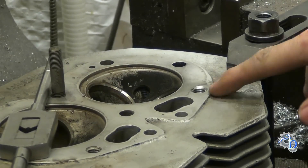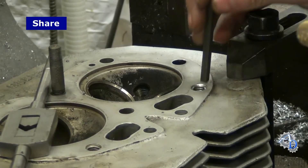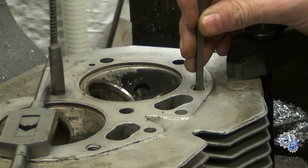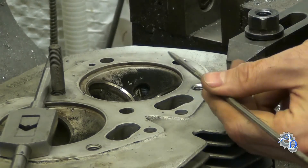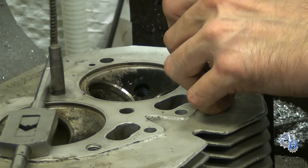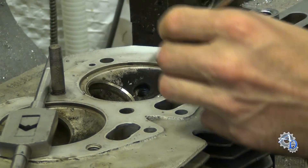When you're finished installing this, there'll still be that little metal tang at the bottom that you need to remove. To do that, I'm going to grab a piece of key stock and bend it over, because there's a notch at the bottom — a built-in weak point so you can break it off. It doesn't take much to bend it over. I'm taking a pointed pin that's been sharpened on the end and breaking it off inside there.